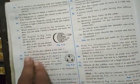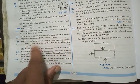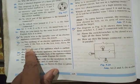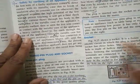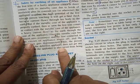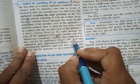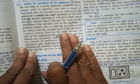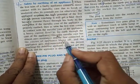Okay, and even there was another question in earthing. The earthing of an appliance is useful only if a fuse is in the live wire. Give reason. Many of you had not written this properly. So I told you earthing helps in two ways. One is it prevents you from getting a shock, and also it protects the appliance from getting damaged. So only if you have a fuse, this will happen. When high current flows, the fuse will melt off and blow off, and the appliance gets disconnected. Otherwise, you would be protected from a shock, but the appliance would get damaged. If you want the appliance not to get damaged, you should make sure there is a fuse in the circuit. Okay, so that is the answer for this question.